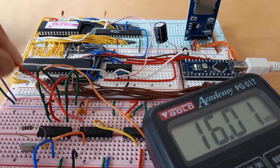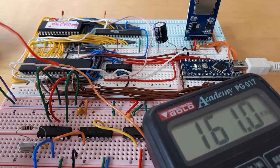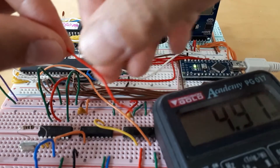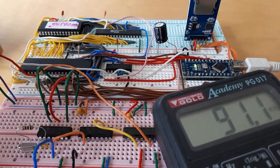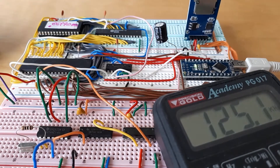There you go — 16 megahertz. And then I've got a couple of chips here which are binary counters, which just divide the frequency down by two at each stage. So what I've done is divided it down and down: 16 megahertz, 8 megahertz, 4, 2 megahertz, 1 megahertz, half a megahertz, and finally down to a quarter of a megahertz and then an eighth of a megahertz — so 125 kilohertz.